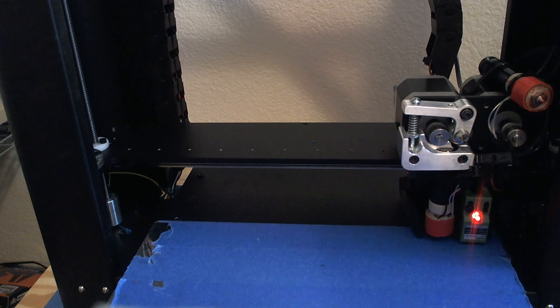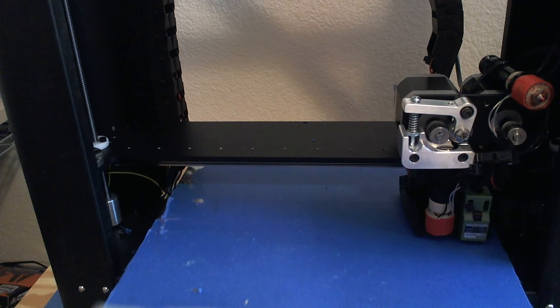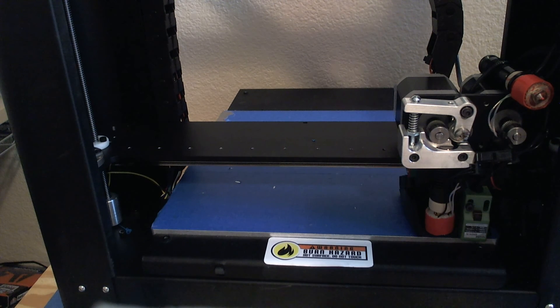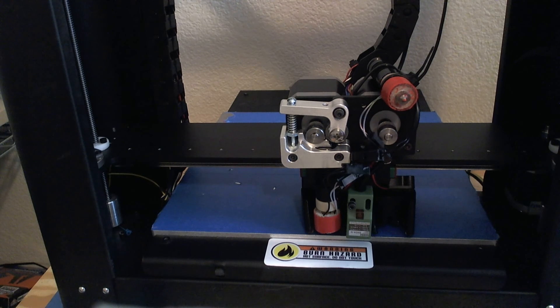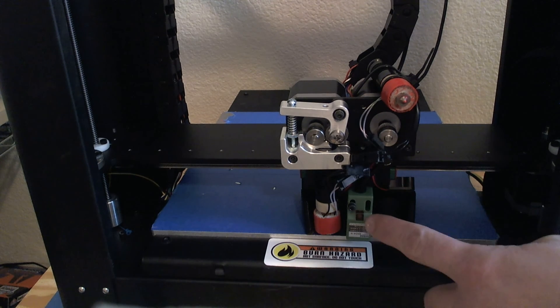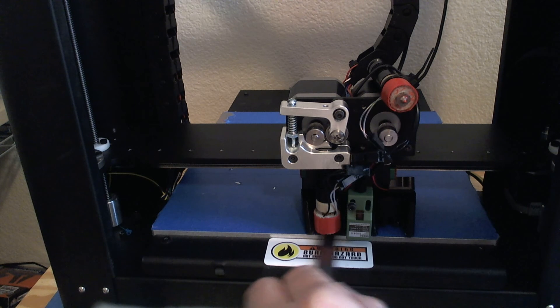If there are other problems I can't detect because of the way it's designed — like on the bottom there's supposed to be an insulated bed and there are only three bolts holding the whole thing on — so if I needed to adjust it as it comes through to the other end. I'm going to raise the Z up and bring the bed out to the center. I'm going to check using M114 to see where Z thinks it is right now. It thinks it's at 1.10. So I'm going to bring it down by a tenth and then 1 millimeter. That light should have detected, but it did not — so you can see the discrepancy with the bed leveling system. That's why this machine needs a bed leveling system that it currently does not have.